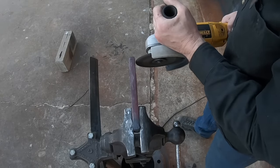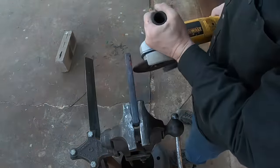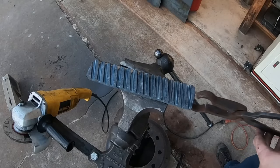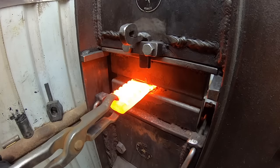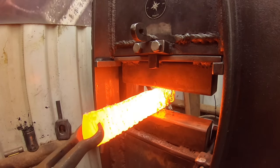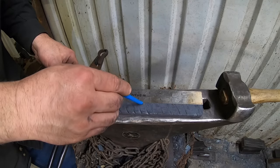We've got a solid chunk of steel there and it looks pretty good. With all these little steel rods in there it really helps the linear tension when forge welding and keeps things nice and solid. We've got this forged down into a flat bar — still pretty thick — and I'm going to go ahead and grind some grooves into this billet to introduce more patterning in our final product. This will reveal the inside of the billet in a 3D manner, which once we continue forging gets exposed in a 2D fashion on the surface. We can then cut it in half and prepare it for the next stage.